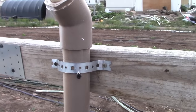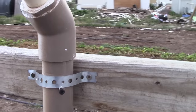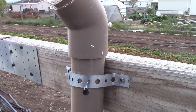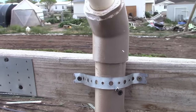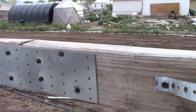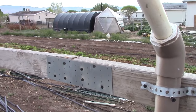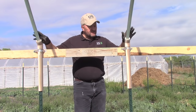For the hip purlin I like to use plumber's strap to hold the T-post to the hip purlin. I also have the screw right here that holds that up into place. That way after I get the plastic on I can release that screw and kind of pull down and keep a little bit more tension on the plastic — it doesn't flap quite as much. You can see here they use these nail plates to hold the ends of the boards together. When you're doing the hip purlin it's a lot easier if you have a second person to help you hold that board up while you put in your plumber strap and nail plates.